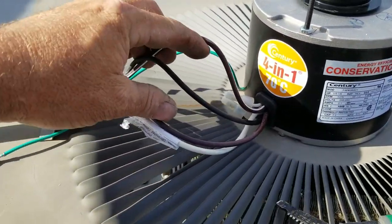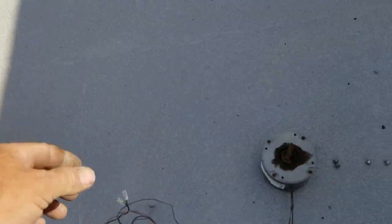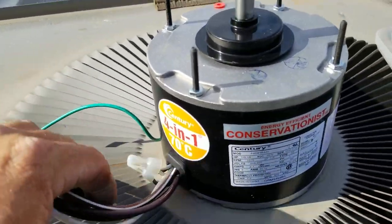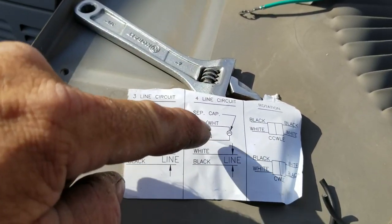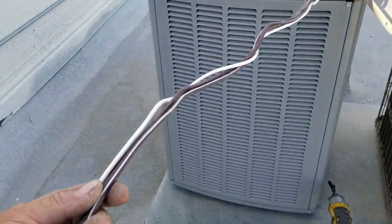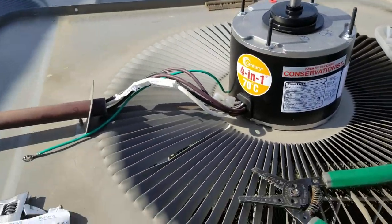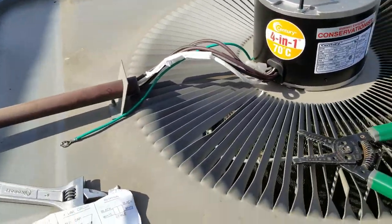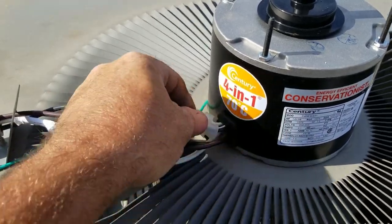Here's the other thing — four wires. People pull out a motor that has three wires; OEM almost always has three wires: L1, L2, and your capacitor, wired just like a compressor. What fools people is they get a new universal with four wires, look at the basic schematic, and don't realize they can just cut off one wire. So they'll hook up brown wire to capacitor and brown wire with white stripe to the capacitor too, then hang the capacitor real close to the motor, leaving the original capacitor still in its location. What I do is take that wire off and cut it — the brown wire to white stripe is cut, nothing connected to it.